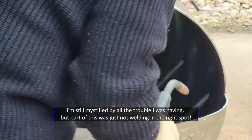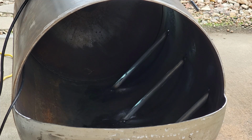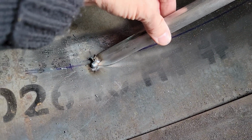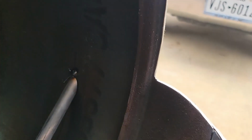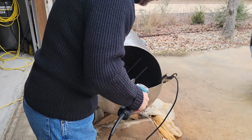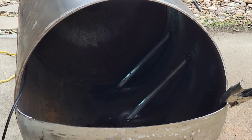No, it is not even beginning to. So even though I put this huge bead here, it's just barely, like that one also, just super ugly, not penetrating the surface at all. I'm going to try clamping over here and seeing if that completes the circuit better. Okay, we'll see if this works better.